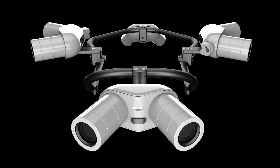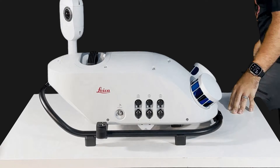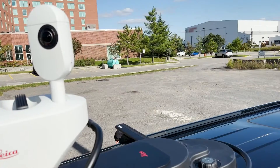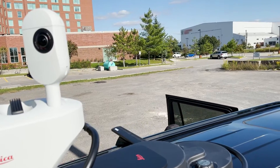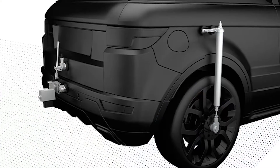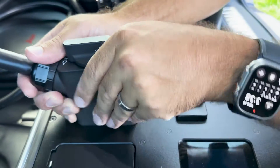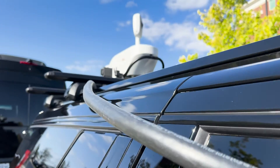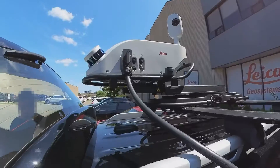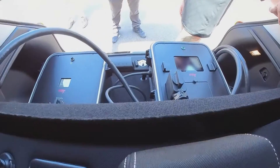Next, if you are using the optional butterfly cameras, snap them into place and connect their cables to their proper ports. Collect any other accessories you plan to use, such as the optional additional GNSS antenna and DMI. Also, connect the TRK-100 to its control unit and battery unit and ensure that there's little to no slack in the connecting cable. Place the control unit and the battery unit inside your vehicle and securely connect them using the push connectors.